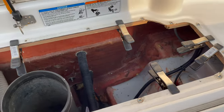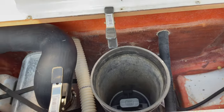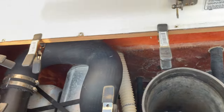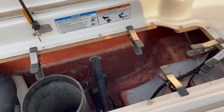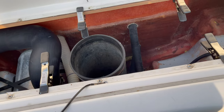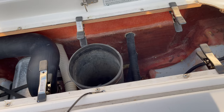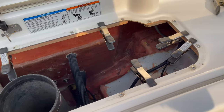And I'm gonna remove the screws now and we're gonna apply the PL Marine sealant to the underside of the wood under here. Then we're gonna screw it back together, get that to set up at least 24 hours or more, just to give us a solid frame surface. And I think we're gonna be pretty good. I'm starting to feel the love that we're on the right path here.